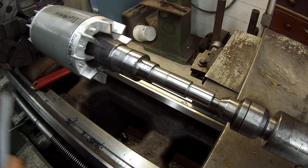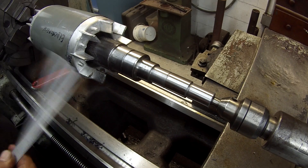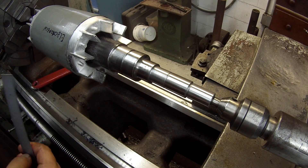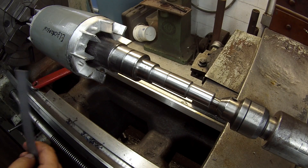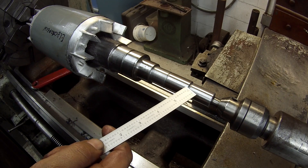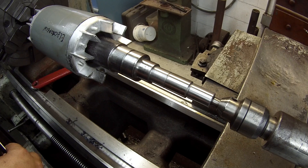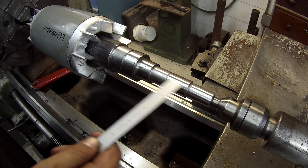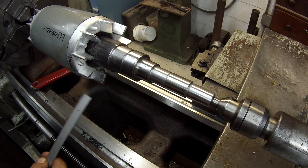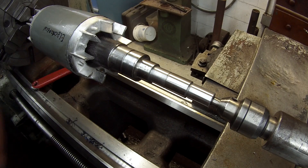But I want to try something different this time. What I'd like to do is go ahead and spray weld this. The powder I use for my spray welder has nickel in it and it's corrosion resistant — it's like stainless. So I'd like to use that on this one here. We'll build it up and metallize it like I've done in the past, and that'll give us a nice corrosion resistant surface for the seals without having to turn this down further, set up and machine a stainless sleeve, and then turn it back to size.